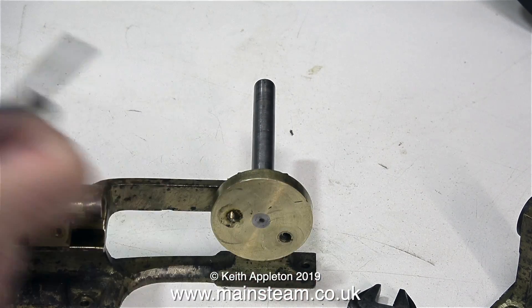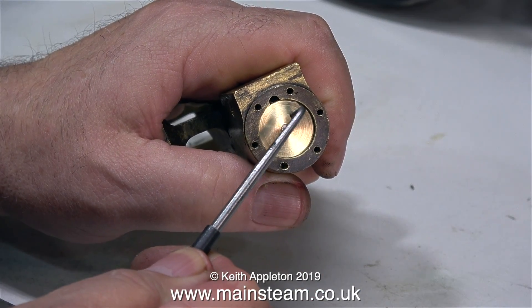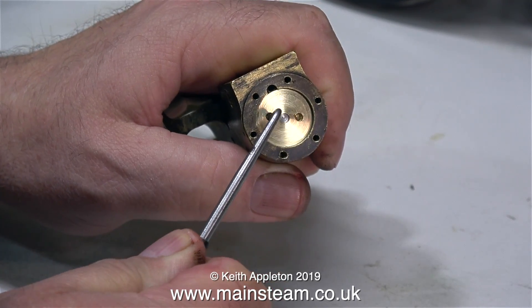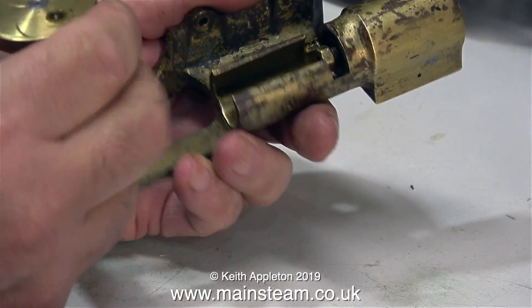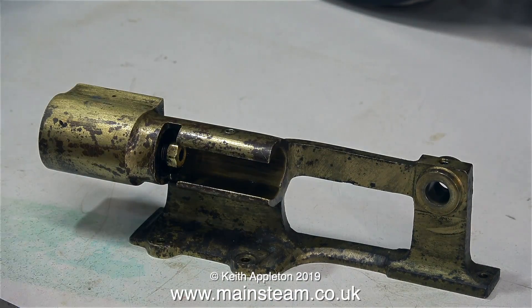It's not a good idea to ever use just ordinary bolts as a bearing surface. The piston's not very tight on the piston rod, so I can remove it quite easily with my right angle scriber. And here I'm sliding out the crosshead, and the final part to be removed is the old crankshaft and the crank web, and I'm going to replace both the crankshaft and the crank web in the fullness of time.